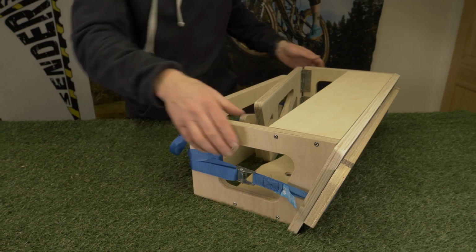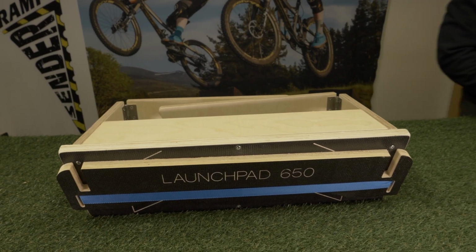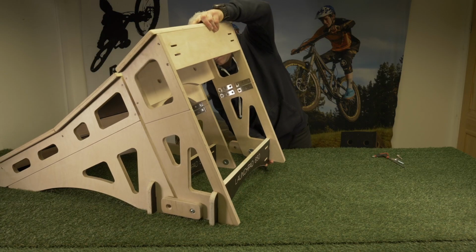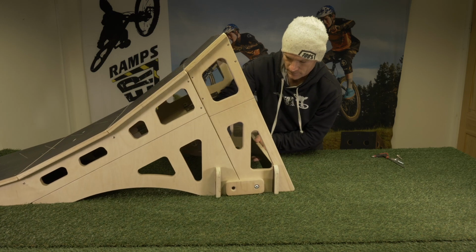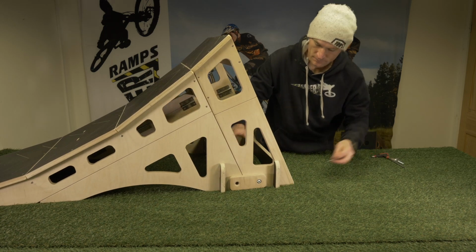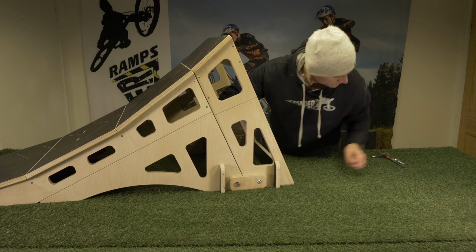The batten is best located on the surface deck. It is essential that you use the 2 bolts in the back plate, the 2 wooden joining block and the 650 batten when you attach the extension to a 500 ramp. Missing any one of these fixations compromises the strength of the ramp.